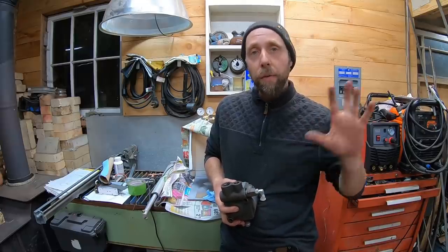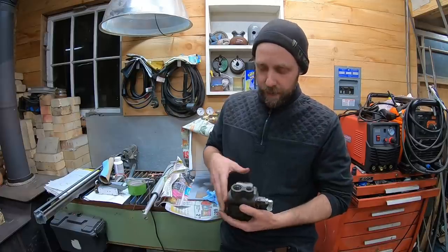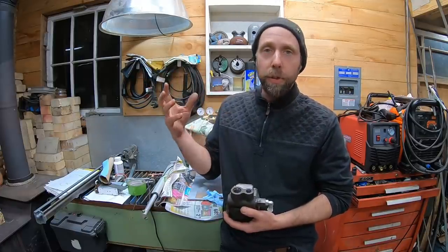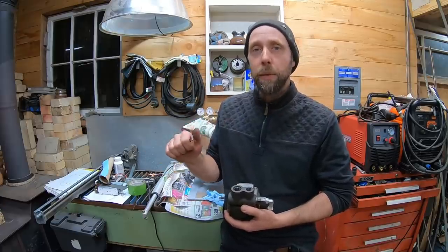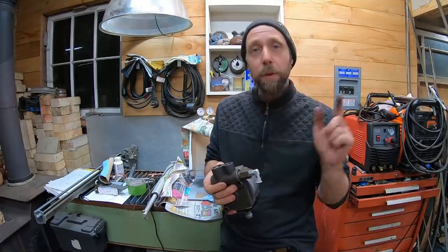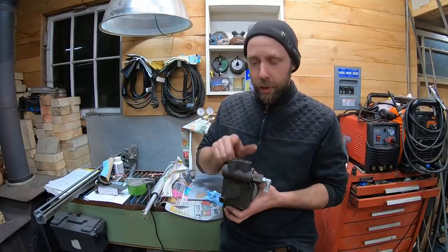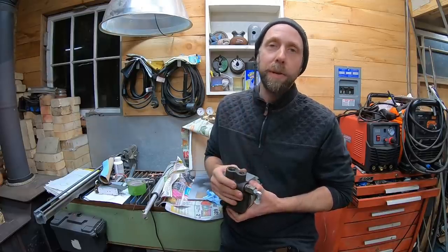And the orbital valve, the one I have, is a 4-port, and you need a 5-port to run this thing. What happens is your hydraulics for your mast and all your machinery works off this main port. It's got priority until you go to steer it. And when you start to steer, the fluid comes in this little side valve here on the 5th port of the orbital, shuts this hydraulic line off here, this output, and then gives full priority to the steering.